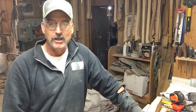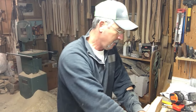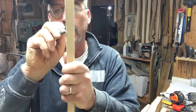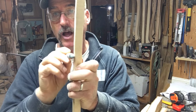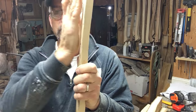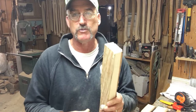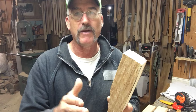Depending on the handle type, sometimes guys want larger eyes. If they want an eye one inch or greater, my three-quarter-inch hardwood is three-quarters of an inch. If I stand my pen up along here at an angle I gain almost another eighth of an inch, and if I gain an eighth on both sides I have a full inch — and if I need an inch and an eighth I'll just start my band saw cut outside that line a little bit. I should also mention: unless you go through all my earlier videos, you won't have heard everything, so I'll start throwing some of those tips back into recent videos.